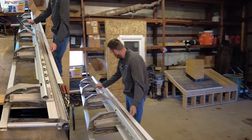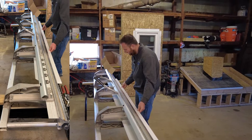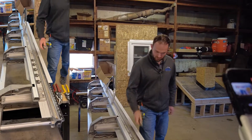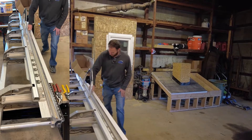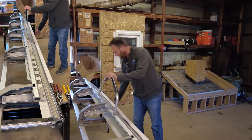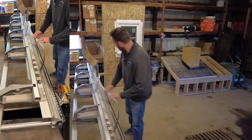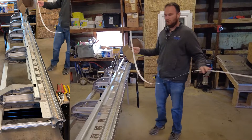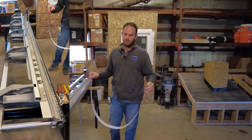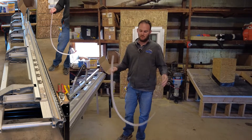I slide this into the brake, choke it down just a little bit to make it stiffer, line it up with my marks, lock the brake, grab my knife, and score the piece of aluminum. As long as your razor is relatively sharp, one pass is enough to score it. Then fold up the handle, bend it a little and it pops right off. Anything you can score and snap is going to look way better than something cut with snips — scoring gives a nice clean edge.